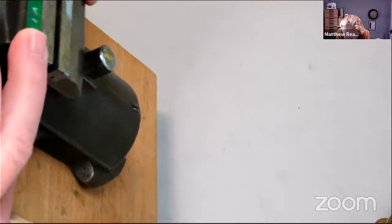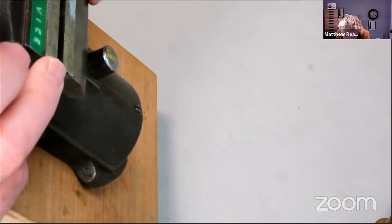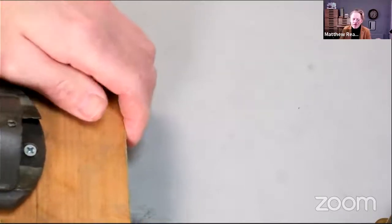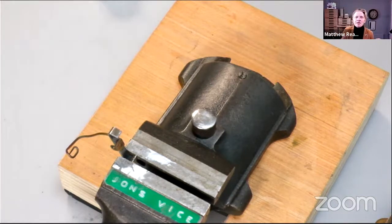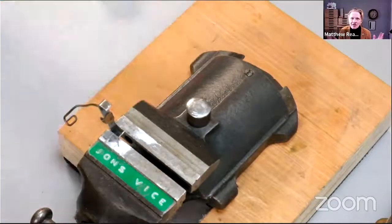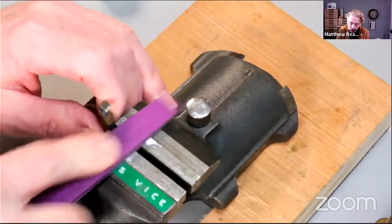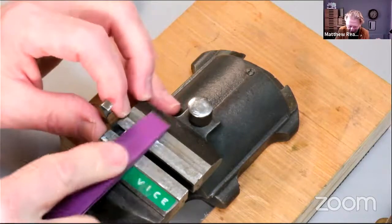Derek asks, if you're going to bend straight, should you do that first before filing in case it breaks? Well, it would save me time. The problem is, until I've filed it, I don't know how much I need to bend it. So the problem is that if it breaks, then I might, what I might actually do is temper them back to blue. That might just help me a little bit with the hardness of them, just in case they are brittle. Yeah, it's right. If I bent them first, at least if they broke, I would know not to bother. But you don't know how much to bend it, because it's this material that we're removing that's going to dictate the new depth and also drop. So not only do I have to bend them closer, but we might have to bend them towards each other or away from each other.